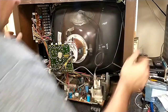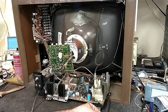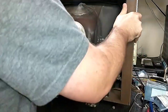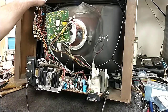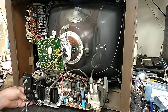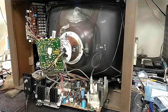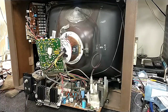So we've got them cleaned up. Let's re-secure our chassis. I don't like that they put the focus inside there where it's difficult to get to. It's a cool design the way everything slides out on the chassis, but I don't think they thought the cabinet and chassis design through well enough, because there's very little clearance to get it past the picture tube. This set did come in multiple variants — one with the Varactor like we have here, one with a rotary-style tuner, and one with a drum-style tuner that had 13 contacts with presets.